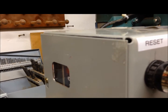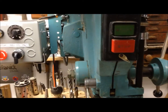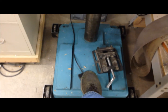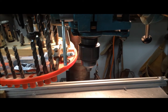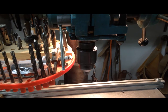So I'm going to turn it back down to 10 Hz and we'll demonstrate the reversing function of the drill press. Down here I've got the foot pedal, and when you want to use the drill press for tapping, you hit the button which starts it in reverse. So it's in reverse at 10 Hz — let it go and now it goes forward and backwards, back and forth.